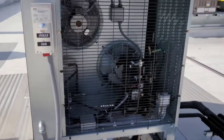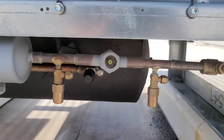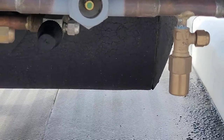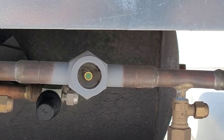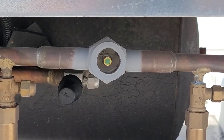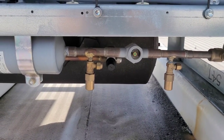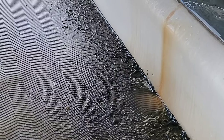Alright, I'm up here at the condenser — everything's good down there, it's reaching temperature. It's lost refrigerant obviously. I gotta try to find the leak. By the time this refrigerant gets down there to the expansion valve and beyond it, that's why we're icing up so much on the capillary tube — due to the fact that it has lost some refrigerant. The sight glass should be full. So what we gotta do is find the leak. Wish I could call it done but I can't. Looks kind of oily down there. Alright, I'm gonna find the leak and show you in just a minute.